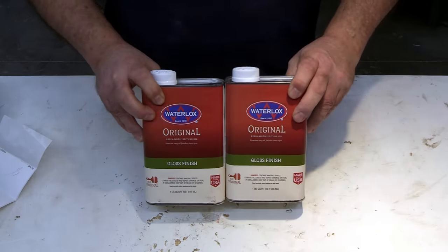I thought that I would show the sharpening of the teardrop cutter. Now I've got my fat fingers in the way for some of this, but that was just a diamond coated wheel dresser that I was using before this. And I just set the tool rest the same as the cutter when it comes from one way, and it's quite simple to sharpen, not hard at all. So there it is again. I thought I'd show it before I throw it back on.